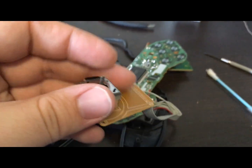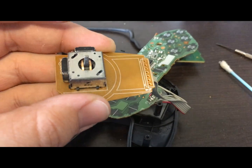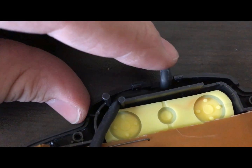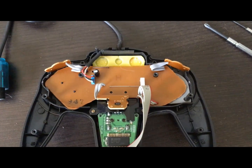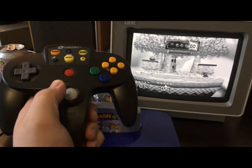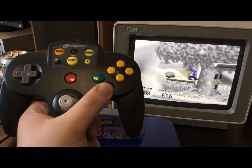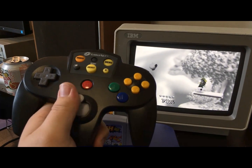The joystick controller board has the same IC as on the Hori Mini controller. The joystick is a standard potentiometer-based design. You want to route this wire securely — maybe dab a little bit of glue to keep it in place. If it works and looks good, it's time to close the controller up. Sure enough, it works great. If it drifts a little bit when you plug it in, just hold L, R, and Start to recalibrate it. That's not a sign of defects — it's more likely a quirk between the Hori and N64 PCBs.